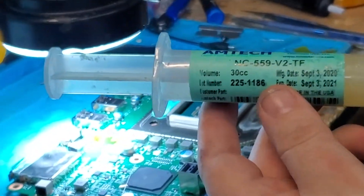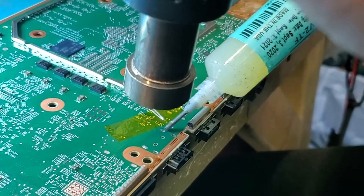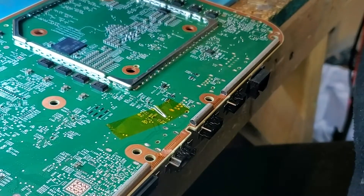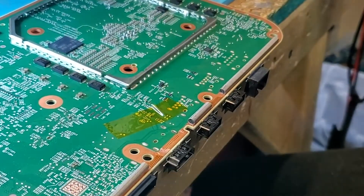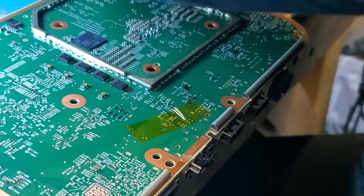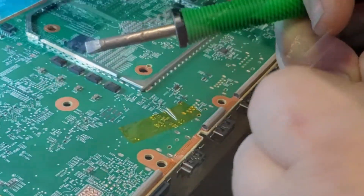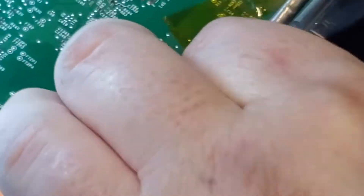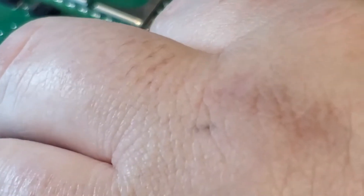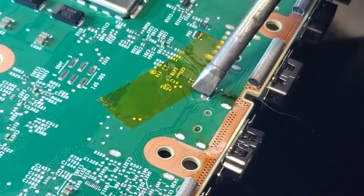Check out our new website, Techies that store. This solder is a little bit tough, so what I'm going to do is put a little flux in there and add a little bit of leaded solder to make it come apart quicker and easier. A lot of people are having a tough time getting these out without damaging the board from heating it too long, so it's a good idea to put in some regular leaded solder so it blends in with the solder already there.